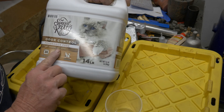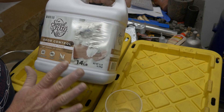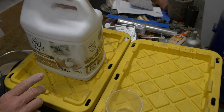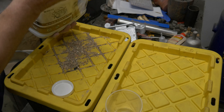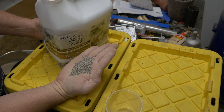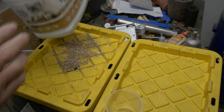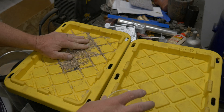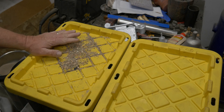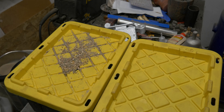This is cat litter — tight clumping cat litter. Don't get the non-clumping stuff. Get the clumping cat litter. You can see what it looks like — it is just bentonite clay crushed up, ground up. It is granular, not pulverized. I used a blender to grind up my first load, but I have learned I do not have to do that. I can just mix the cat litter and dry sand together, add water, let it set for a while, keep stirring, and it will eventually break down and blend together without tearing up a blender.